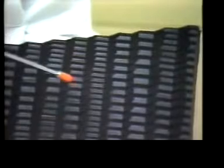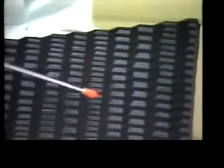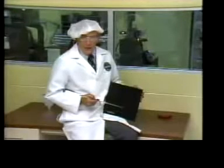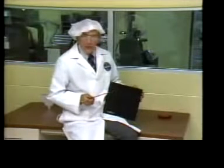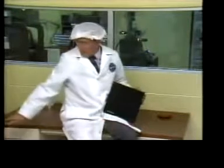Well, by the way, the lathes are mounted on a floating suspension system. Just the slightest seismic disturbance could alter the signal cutting process. To give you an idea of the dimensions we're talking about, here's a groove mock-up 10,000 times actual size. These are the undulations of the signal the cutter is vibrating 3 million times a second to produce. The player's stylus rides in the groove and reads the signal as it passes over the peaks and valleys. In contrast to this, which recreates 10 video disc grooves, one groove in an audio record would be about, well, the length of this entire table.